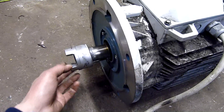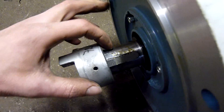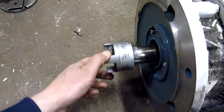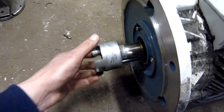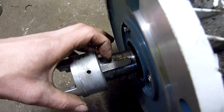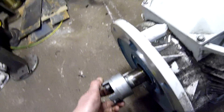When I got it, the bolts had signs of being removed before — the paint was all broken off them. And just the fact that this coupling shows a mark from a previous coupling being on there, I'd say this thing has shredded its flexible disc and eventually eaten itself at one point, and they've thrown a replacement on. You can see up there — they've had a larger coupling on it at some point, so this one must be a replacement.